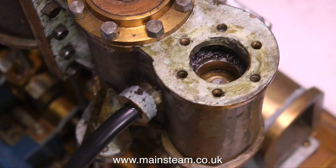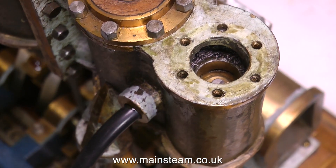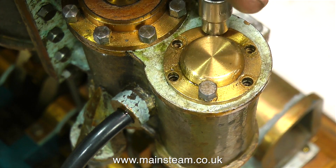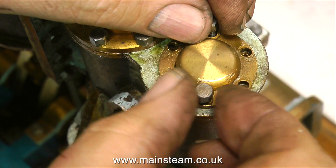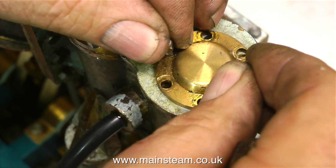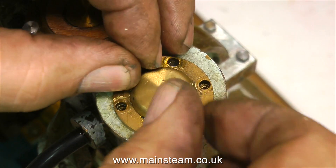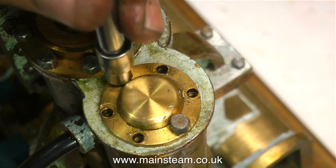In this clip, you can clearly see the piston valve down in the piston valve chest. If I can rotate the crankshaft — which is very stiff — the piston valve should go up and down. You can see the valve does actually move in the valve chest, but not very much, because I cannot turn over the crankshaft by hand. Looking at the engineering standard, it seems that this valve chest cover only fits in one position, but it's still very well engineered.